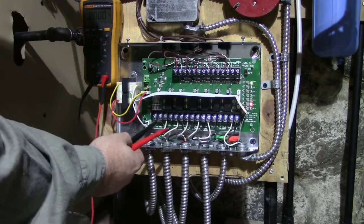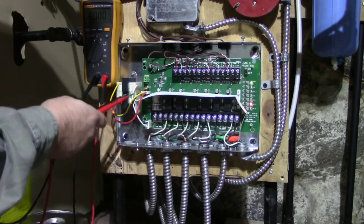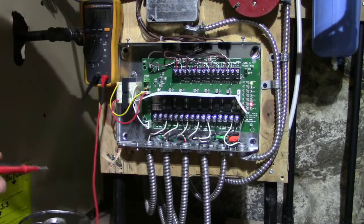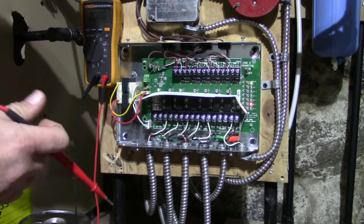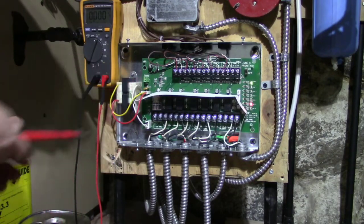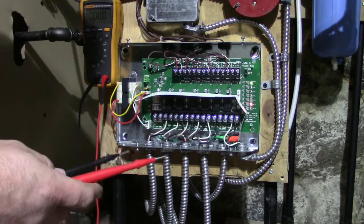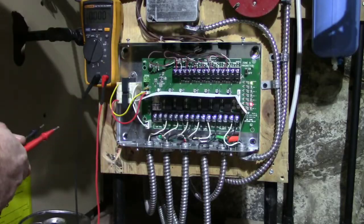Here's my zone board down here. These go to circulator pumps; there's 120 volts down here feeding a transformer, and we go to the low-voltage side — 24 volts — at the top. Right now it's on and we have an output of 24-volt current, which is great because that can help us pull the neutral we're looking for to run the thermostats.